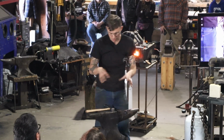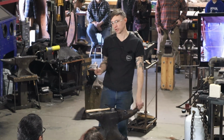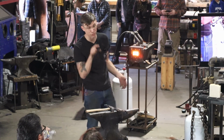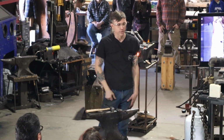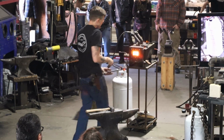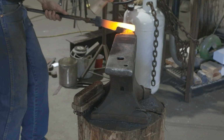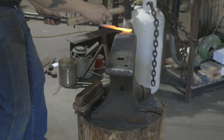Again, it looks smaller in the forge and it'll look bigger. A lot of times people go, I ruined my handle, it got so small. And I'll say, just go over to the case, grab a couple knives, grab some of the ones that look thin, see if they're comfortable. Then measure them. Oftentimes, cross-sectionally at the thinnest point where you grip it, they're something like 3/4 of an inch tall. So it often just looks way too small on the anvil, and it's not. But they can get too small, so just don't do that. Probably. All right, that's fine.